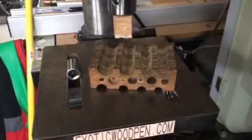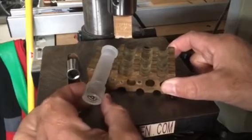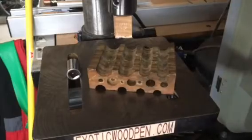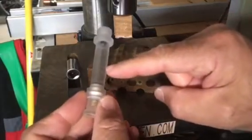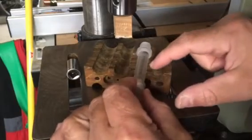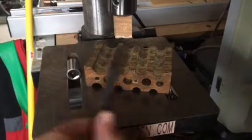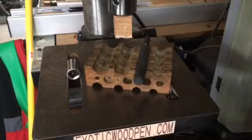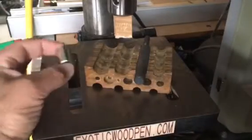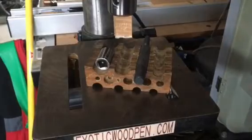At the drill press you can see my clamping block. This is a three-quarter inch channel, and that fits the upper for the cap. For the lower, being that this is a half an inch right here, that one's too big — so this one's a half an inch. I'm just going to use a punch for that one right there. That's a 5/16 punch, and given the gap of the gear, that'll fit nicely. For the cap, that's a 13-millimeter socket, which fits in that gap nicely.